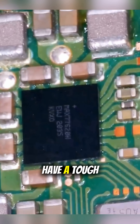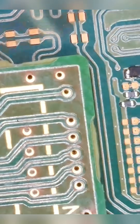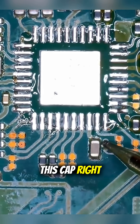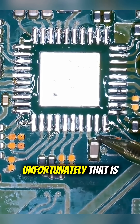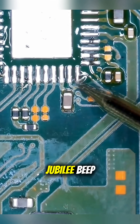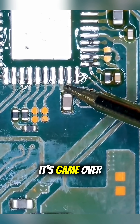We have walked into a little bit of a tough one here. Into test mode now — we have done our visual inspection. We're in continuity mode, which is the mode that beeps. I just want to check one thing — I'm going to check this cap right here, straight off the bat. Do we have a short on this cap? If so, it's game over. I don't believe it. Unfortunately, that is a CPU cap. This side is ground, which beeps — lovely. But this side, yeah, if it beeps like it is, it's game over. That is in fact a dead short to ground.